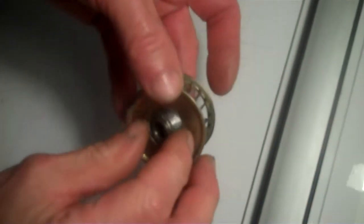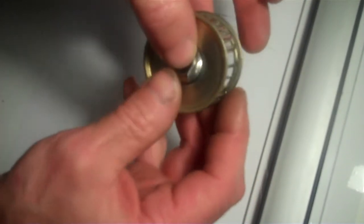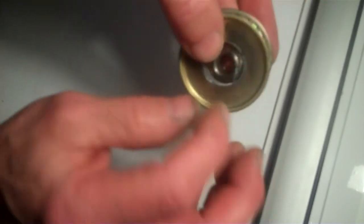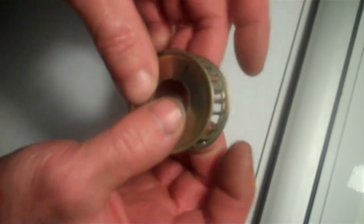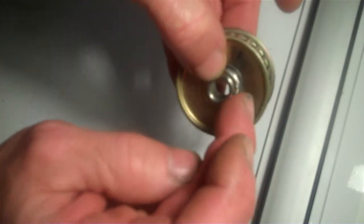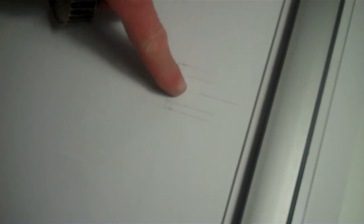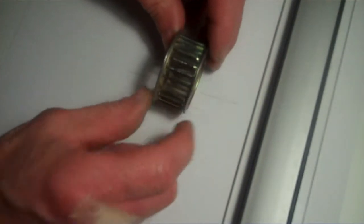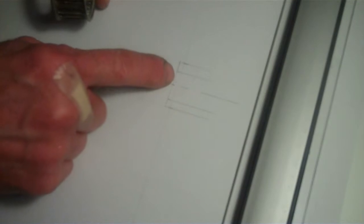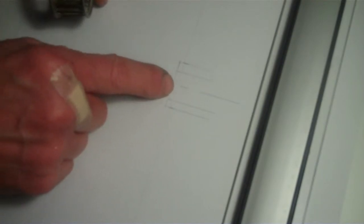450. Okay, so that means that when this flange is sitting inside here like this, it was sitting here on the shoulder at 375, and then this protrusion is at 450, so that is 375, 4, that's 25 plus 5, that's 75 thousandths. So that's 75 thousandths below this area here. And on the drawing here, right, this flange will be sitting here. This is sitting on top of this. So it'll be from the bottom line here down 75 thousandths.